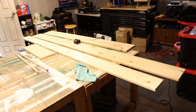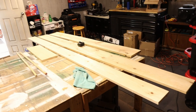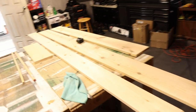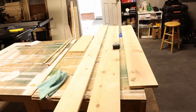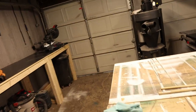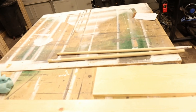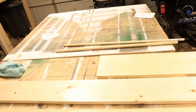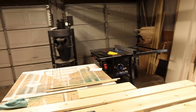We're back in the shop and luckily we have some leftover material from the DIY dresser video — if you haven't watched that I'll have it linked down below. Essentially what we're going to be doing is ripping these down to our desired height, which is going to be 70 inches, and our width about 22 and a half inches. I'm going to rip it down on the table saw and use the miter saw for the crosscuts. The only thing we'll have to purchase is some dowels. This is just for test fitting to see which width dowel I like better in correlation to the shelves. It's going to be very DIY friendly so stay tuned.